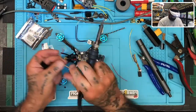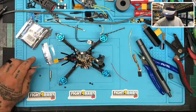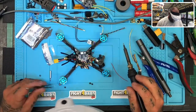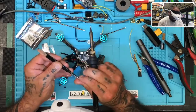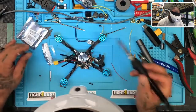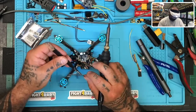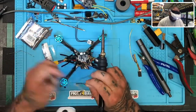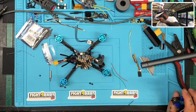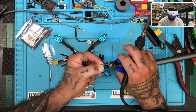That wire is out — not needed. I'm going to set that aside and clean the tip of this soldering iron. I'm going to add a little bit of solder of my own just so I know I've got something that's going to melt easily. These wires are a little long, actually, so I'm going to trim them back a millimeter or so.